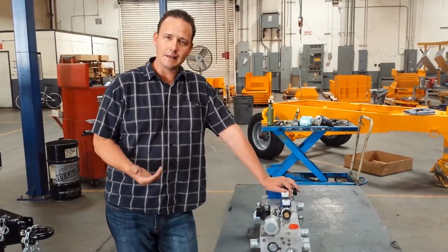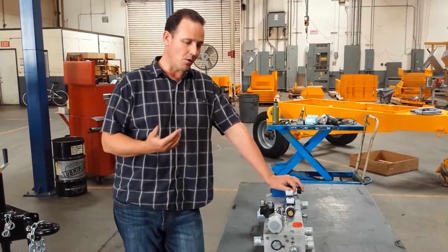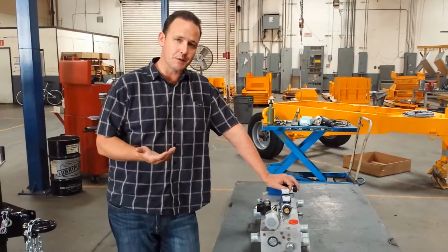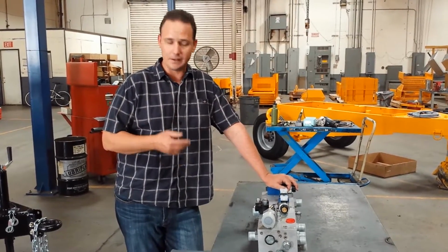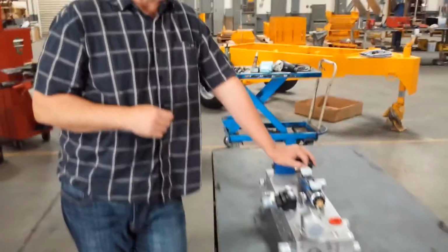Now that we have a basic understanding of what and how our machine cycles, we're going to go a little bit deeper into this system and learn how pressure is managed. Starting with the swing circuit, because again, with the A Series machines, these theoretically can't cycle unless we have swing pressure, because once again, that swing pressure is used as pilot oil to shift our cartridges.